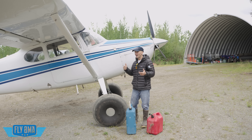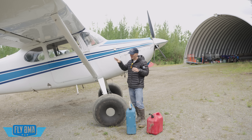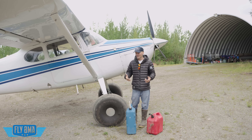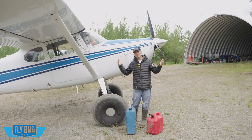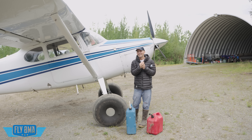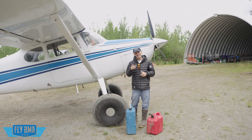There are vapor lock issues and all these things, but I've never had engine failures with auto fuel, and it starts a lot easier in the winter. For at least us here in Alaska, it works great. If your airplane is STC'd for it — and getting an STC typically doesn't modify the airplane anyway, it literally is just a sticker you put on there, sometimes it's free, sometimes it's a few hundred bucks — it goes in the log books and then you can legally run it. I would highly recommend it. Obviously do what's legal for your airplane. Love the experimental world, love mosaic that's coming out — hopefully that'll loosen things up for us as well. If you guys have any questions, thoughts, or opinions on this — and I'm sure people do, we're pilots, have you ever met a pilot without an opinion? — go ahead and leave your thoughts, experiences down in the comments below. As always, if you cannot fly every day, fly8mikealpha.com. We'll see you guys in the next one.